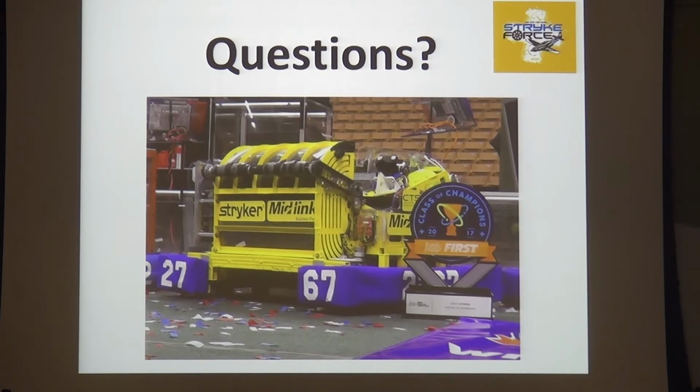If I made P any higher, it oscillated. Also, when you put the ball through it, there was no inertia. It sucked a lot of energy out of it. That thing slowed down. So we machined up a flywheel and put that on it, and much as you saw here, huge difference. That was good, let's do more.